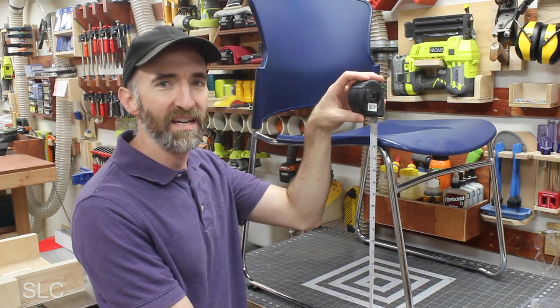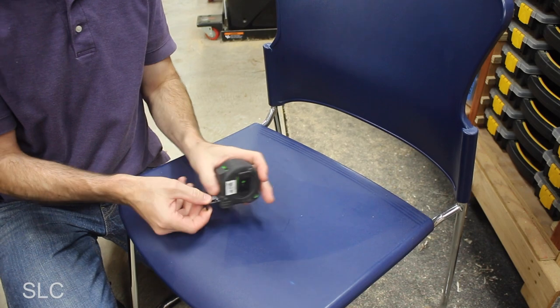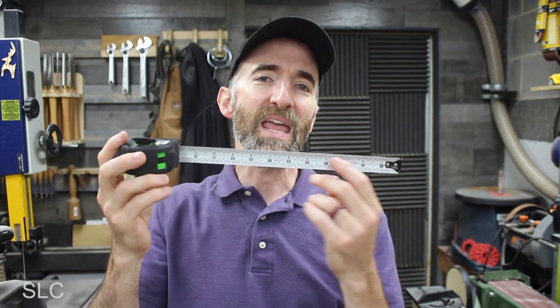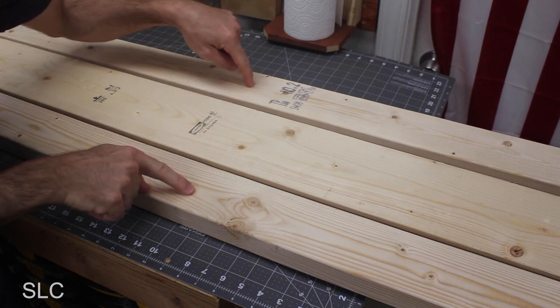The best part is we're going to make this entire bench seat out of simple dimensional lumber. Now a standard seat is about 17 inches tall, but of course a child's legs are much shorter than adults. So I'm thinking if I go down to about 14 inches, that should work well. And we don't need the full depth of a chair, which is about 15 to 16 inches, so I'm going to aim for about 11 and a half to 12 inches. I believe I can make this bench seat with one 2x6 and two 2x4s.